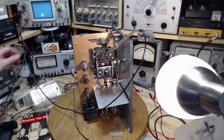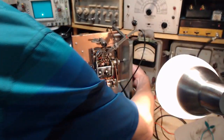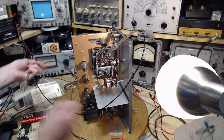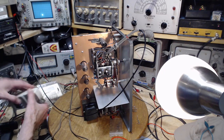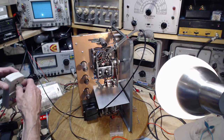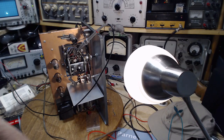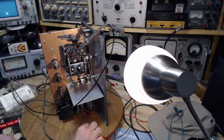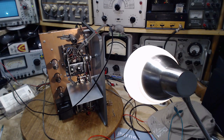Are we all set? Not plugged in. Okay, so I made a bad mistake from a safety point of view. I did not follow my standard procedure. If you don't follow the standard procedure, an accident can ensue. My standard procedure is to plug this into here, then I have control with these switches up here, which I can see. I plugged this into a regular outlet for some reason, I can't remember why, and I forgot I had done that. I then looked up at my control panel switches, which are in the neutral position, meaning no power at this thing. I then looked over at it, and thank God I could see a tube was glowing. Because I was setting myself up for a bit of a surprise there. The non-standard procedure, plugging it into a regular outlet. I'd almost never do that, and then forgetting about it.